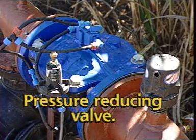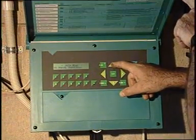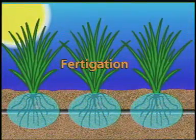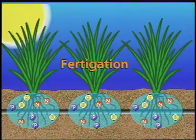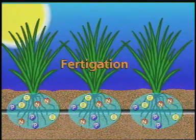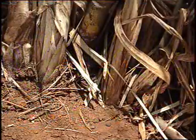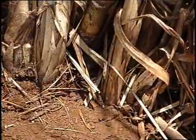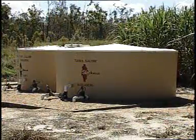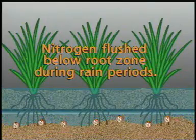While a computer controlled system isn't necessary, when such a system is used it's possible to provide proportional fertilizing to the dripper lines. The ability to bring fertilizers directly to the root zone of the cane plant, right where they're needed, is one of the greatest advantages of subsurface drip irrigation. Fertigation, as it's become known, enables the grower to add fertilizers at precise intervals, and this has a dramatic effect on crop yields. The grower has the ability to respond to the crop's fertilizer requirements as it grows. When nitrogen is flushed out below the root zone during rain periods, it remains possible to add fertilizers through the dripper lines when conventional fertilizer application methods would literally get bogged down.